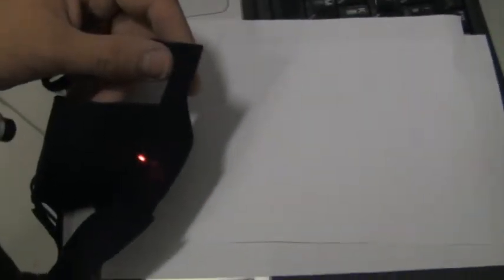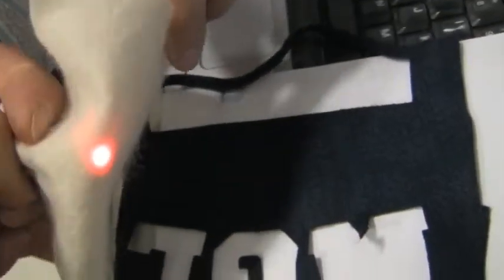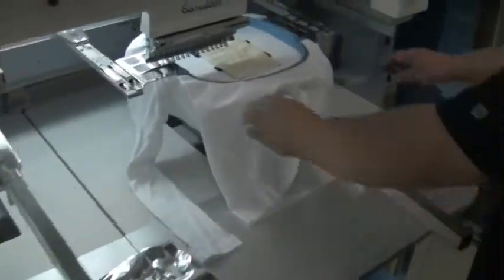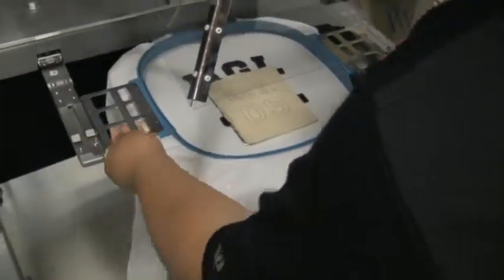Look at the size of my dot — it's a big fat line. The laser that's cutting is not this thick; it's a thousandth of this width. So I'm going to grab a white piece of felt — and it's even worse. I'm shining through and there's a lot of red light going through. So if this big regular pointer laser sends it through, you can guarantee that the cutting laser will always get through. That's the reason for the foil, and that's what most salespeople won't tell you. They'll try and sell you the laser based on not needing foil, and then when you go into production you'll lose your mind. You'll call us for the foil anyways — and I say that because it's happened.